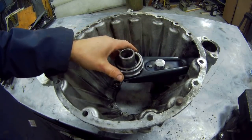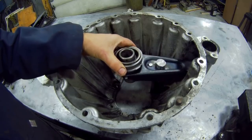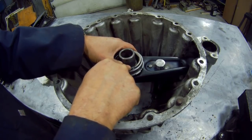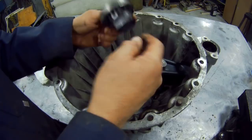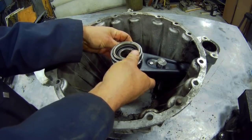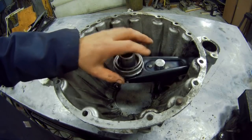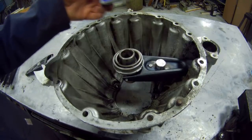Because this is on a radius, you might find that the clutch bearing at one point is a little bit tight, not quite free — it's okay, it's not a problem. I have noticed that with a standard arm, if you're going to put an aluminium heavy-duty bearing in here, sometimes the tolerances of this bore are a little bit tight and it can bind up. It'll eventually wear in, but the plastic ones are just as good. I can't understand why they use aluminium ones for the housing — the plastic ones, these genuine NSK ones, we've had no problems with them.